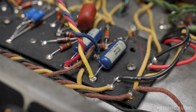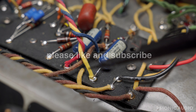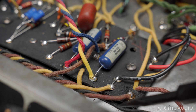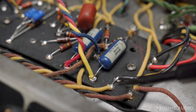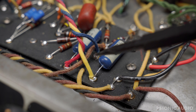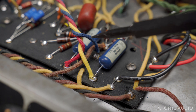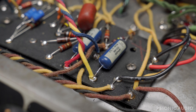Getting started — this amp used to have two bias leak resistors, between the blue wire and the yellow wire, and between the blue wire and the red wire. I removed those resistors and removed the wires going from the yellow and red points to the tubes, and I've replaced them with these wires you see here. It's very important that you keep the color code the same. The blue there is going to the bias, and the red and yellow are going to the outputs of those coupling caps. I have the red and yellow twisted tightly together, and then the blue is just wrapped around the whole thing — that gives a benefit much better than traditional shielded wire.